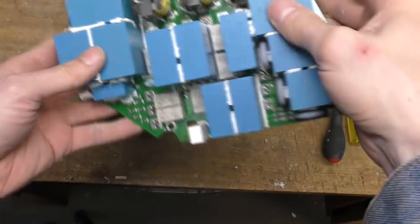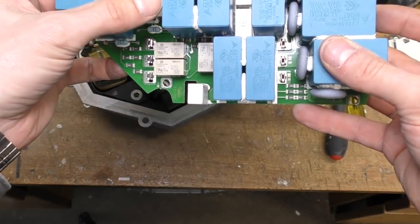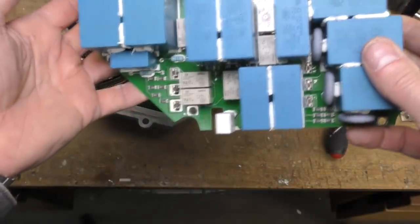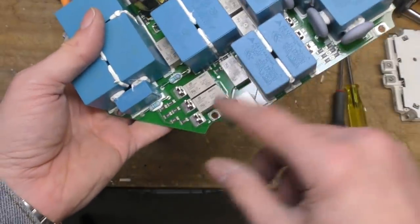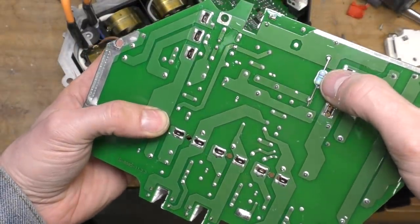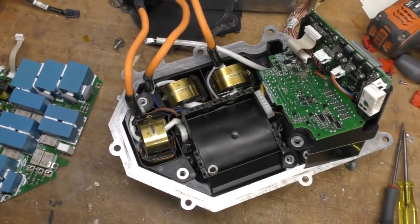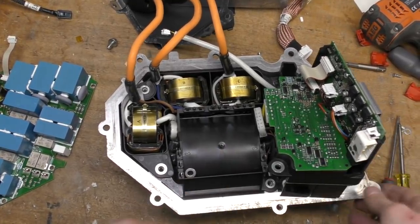Getting this first board out — although there's a lot on it, it probably isn't very complicated. There's only a six-pin control connector, and I suspect it's basically three fairly identical circuits. We've got large 10 microfarad 300 volt capacitors, some power resistors, and three inductors, with a lot of duplication. It could be reconfiguring the filter depending on whether it's single or three phase. There's also a bodge — a 4.7 megohm resistor across one of the caps, probably just providing discharge for those caps.